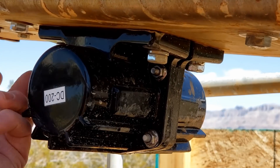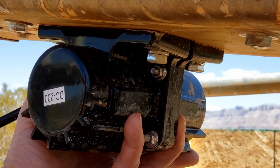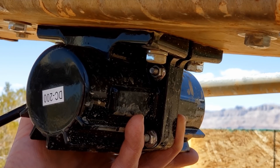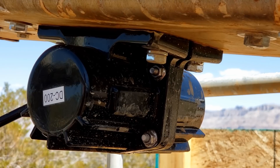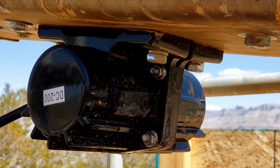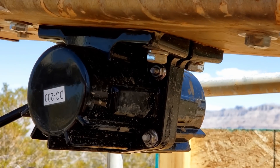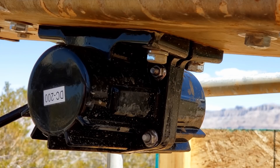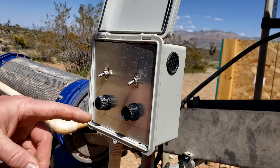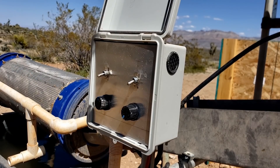Perhaps the most important modification is the vibrator. The old vibrator had a couple of bearings, a motor turning at 2,000 RPMs with a shaft and counterweight. I replaced that with this new vibrator motor - it's much more compact, turns at 7,000 RPM at full power, runs about 5 amps at 12 volts. It's actually a concrete vibrator that can lift 200 pounds of concrete. This is way overkill for this machine, but I like overkill. At 7,000 RPMs it would literally sling rocks right off, so I have a 10 amp speed controller to adjust the motor speed so it just adequately gets the rocks dancing around.